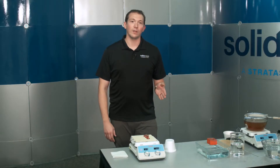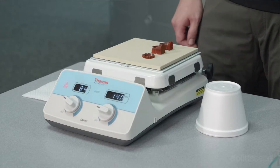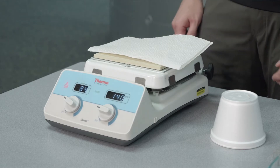Keep the temperature of the hot plate below 90 degrees Celsius to avoid damaging your waxes. You can cover your wax with a box, styrofoam cup, or paper towel. This keeps the heat trapped, creating an oven, helping to melt the bottom support layers.